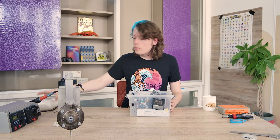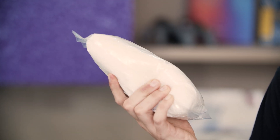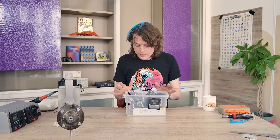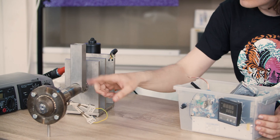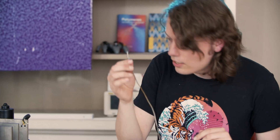This is a PID controller which sort of controls temperature at the point where I want it to be. For the plastic we're going to use here, I think ABS needs 220 Celsius. We only have to connect the motor, the heaters, and the thermocouple. The thermocouple is the easiest because it's already attached inside — there is a tiny hole and this is where the thermocouple goes.